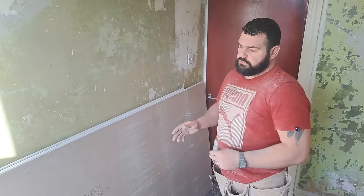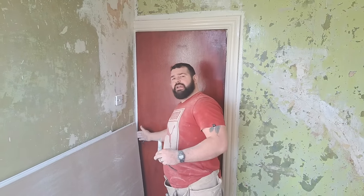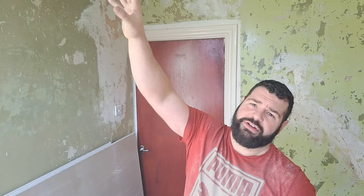When you cut the first board, always want the cut edges to go towards the walls so the nice factory-made edges are in the middle of the ceiling — it'll be a neater job. On this first board I'm going to show you how to get around having a light in the ceiling when you're trying to overboard, because getting an electrician is added expense and time. I'll show you a nice easy way to overboard the ceiling and still deal with the light fitting neatly.